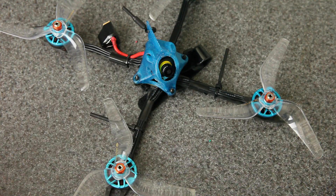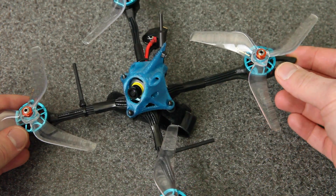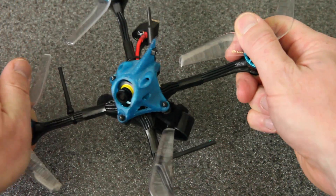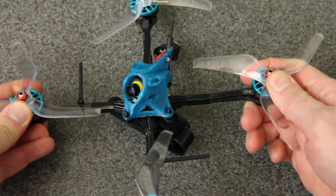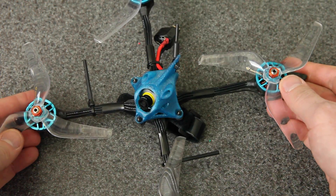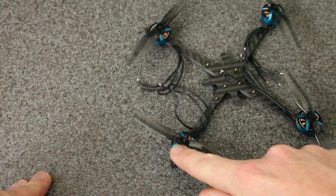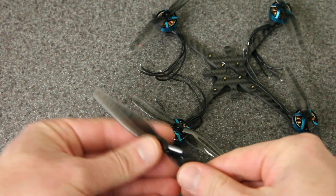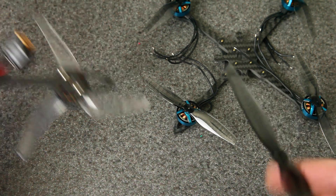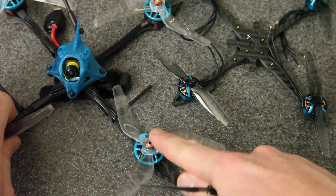I'm going to get out there and give it another go, see if we can get this thing flying a little bit better. But I'm starting to wonder if it's ever really going to fly great, and the reason I say that is because these motors are really big for this frame and there's just not a lot of rigidity. If I twist the motors this way there's actually quite a bit of play, and that's just because this arm is so skinny. I suspect I'm going to like the 4-inch version better, but I won't know until I try it. Another thing I'd love to try is putting these 1505 motors with the new HQ 5x3 prop on a 5-inch frame. Unfortunately I can't put these motors on the BetaFPV frame because it only has 16mm mounting holes, which means this frame can only be used with these really big motors.